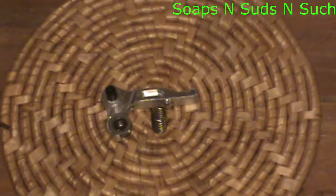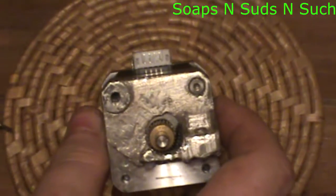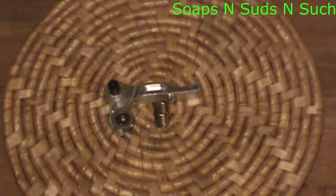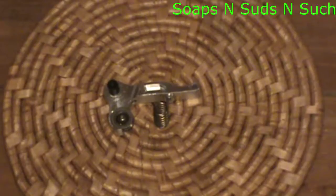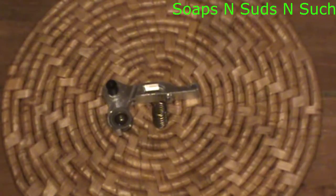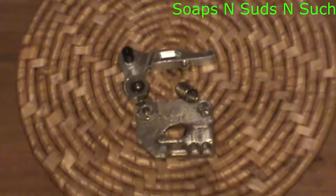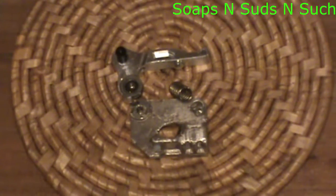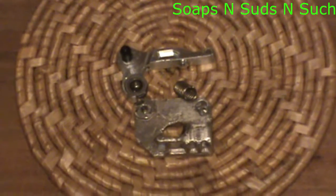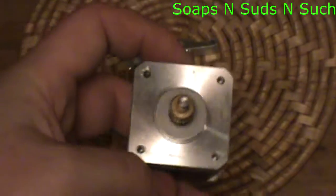The leveler arm and spring both come off one screw. That also means the plate is held on by only one screw, so all you have to do is loosen that screw and it will come off. As you can see, there's my extruder plate — it has come off the stepper motor and now the stepper motor is blank.